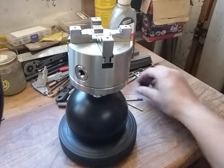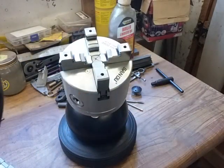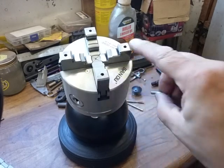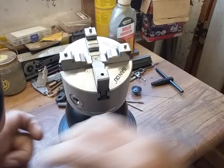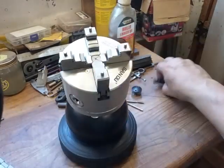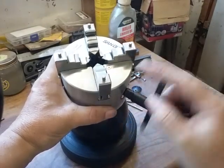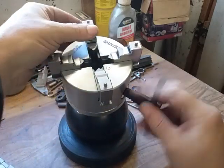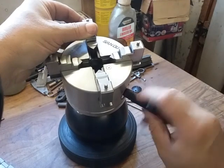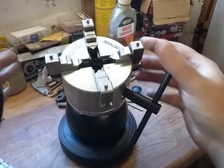And what else I've done to complement the chucks, to mimic the ones that you can already buy from retail world, I've drilled the chuck here. You can see I've drilled these jaws to take these little pins. There's 4 of those. And the holding capacity of this is quite enormous compared to the run-of-the-mill engraver's vices, basically. So you can come right out to a distance of comfortably there, probably 5 to 6 inches diameter.